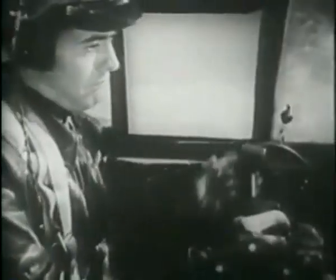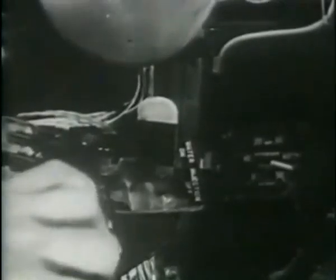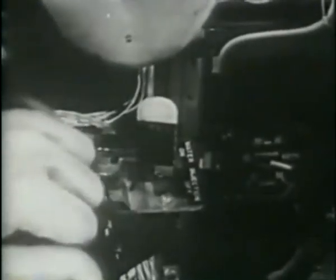If, in an emergency, you need the absolute maximum performance, use the water injection which is found on most P-61s. Just shove the throttles all the way open. That turns on the pumps. And then push the water injection switch. That sends the water into the engine.